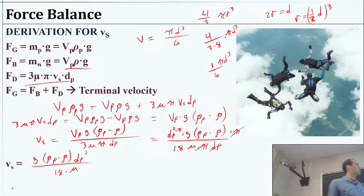We could make the stuff less viscous. So if you were trying to sediment something in honey, that would happen a lot slower than in water, right? So you could maybe change the viscosity a bit, increase the temperature, but none of that has nearly the effect of increasing the particle size, because that component is squared. So if we can do anything to cause particles to become larger, that's the preferred method.